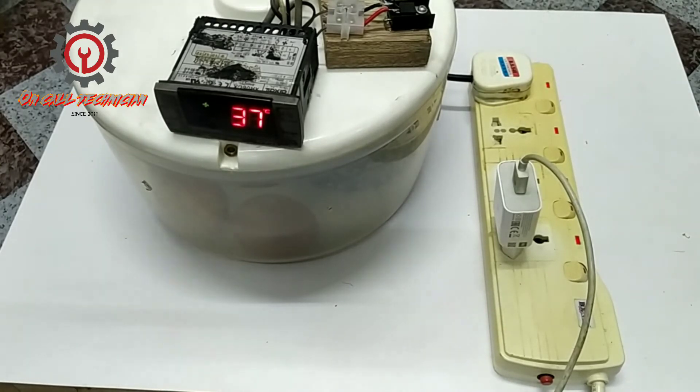My programming with the Dixel XR06CX is successful. For those who were asking how to set it up — just review and follow what I entered into the parameters: IP, IF, DLS, HY, and the set point. By the way, I entered 2 degrees Celsius for the HY differential setting.